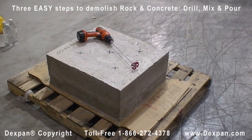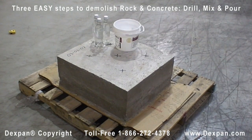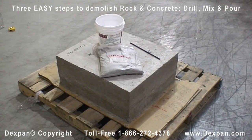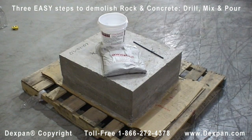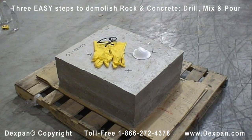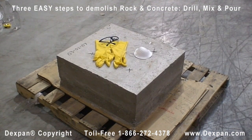A hand drill with a mixing paddle and a flat-bottom bucket is recommended to mix the Dexpan. As an option, a 500-milliliter soft drink bottle can be used to measure water. Be sure to select the correct type of Dexpan for the proper temperature range. In this demonstration, the temperature was about 70 degrees Fahrenheit, so Dexpan 2 was used. For your protection, wear safety glasses, a dust mask, rubber gloves, and proper clothing when working with Dexpan. Avoid eye and skin contact and do not inhale the dust.